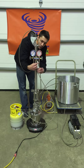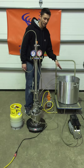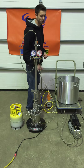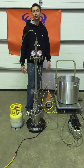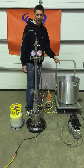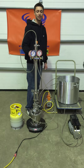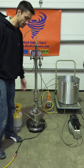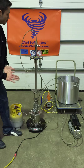There are a couple of different considerations when using the MT69. You can use it right as solvent comes out of the extractor and cool it before it gets to the pump, or you can cool it after the pump. I've tried both ways and seen a negligible difference I can't really measure. In short, the MT69 provides a good cool flow of butane. Without it the pump gets hotter and hotter, bringing in hot gas — which we don't want. With it, everything gets nice and cold. I do have a sight glass down here to monitor where my butane is.